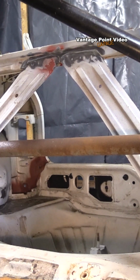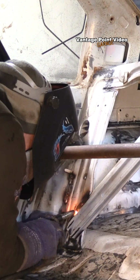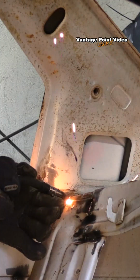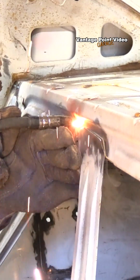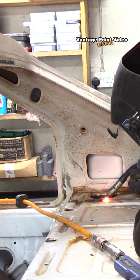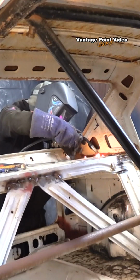So these stays, which form the back of the back seat, I haven't actually been in a Kadett D saloon where this hasn't cracked, so that really shows. They break up at the top of that diagonal, and that shows that stresses from the car are transferring into this, so it would be nice to help it to be more rigid. Now the seatbelt bar that I put into the cage will help with that too. This one was broken before and repaired by somebody else, and you can see those are factory welds down at the bottom, because their spot welders wouldn't have been able to reach into that section, so somebody must have dived in here quickly in the factory and hastily MIG welded those.